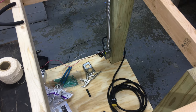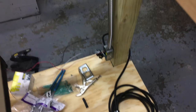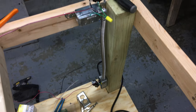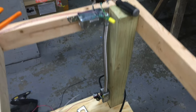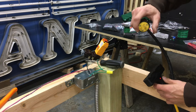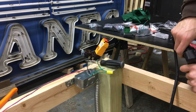Now I'm wiring the vacuum pump circuit. This outlet down here is going to be switched, so it's not hooked up to a hot wire yet. I've got an extension cord because this table's on wheels — it can be mobile, I can move it wherever I need to. The outlet up here currently is the only one with a hot wire. I've got a little outlet tester in there — I'll plug this in and do a little continuity test. If it's correctly wired, the two orange lights on the right will light up. Three, two, one. Wow, I can wire one outlet. Good job!